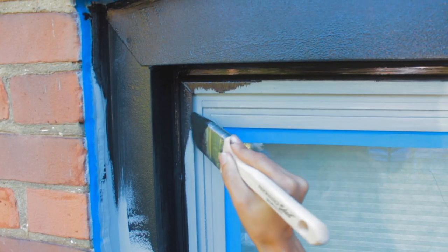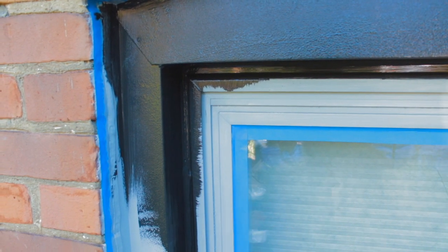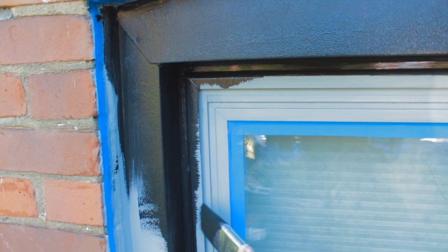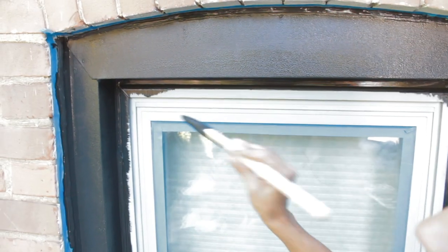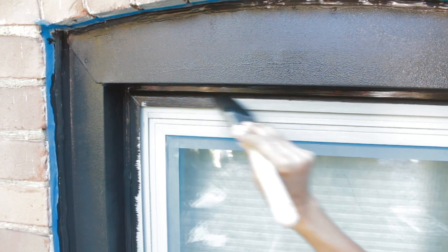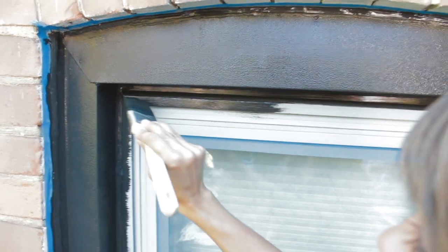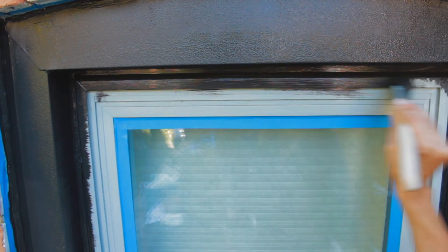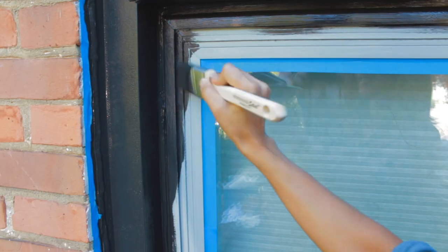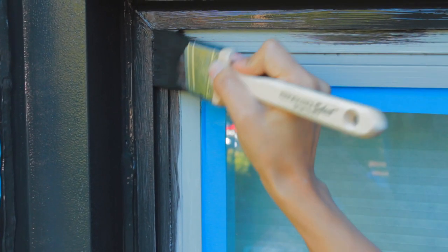That's going to just buy you a little time. If you ever get a little too much paint on your window, just feather it. Same with your trim, and that way it will blend in when it's time to go over and paint. We're just going to go over that, starting at the top corner, and start painting our vinyl window here, or if you have a PVC window. Get into the grooves here, into all your runners where your window is.